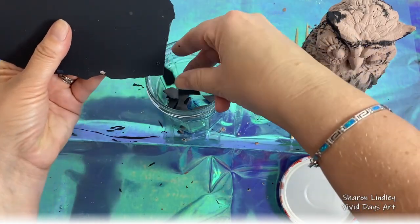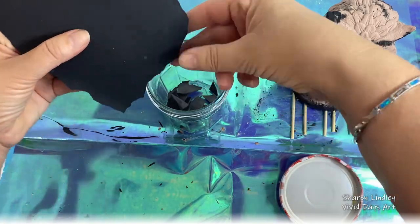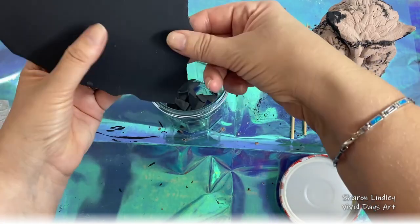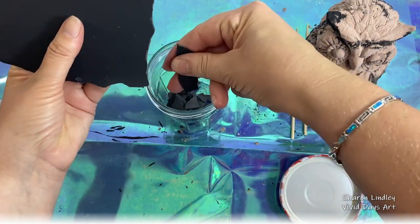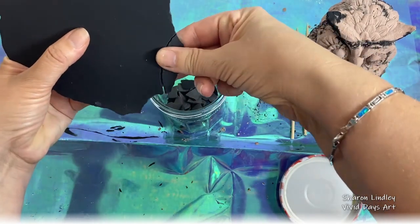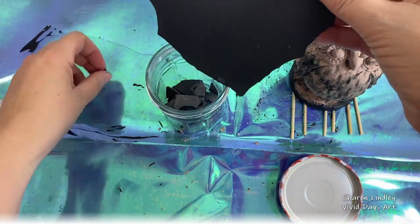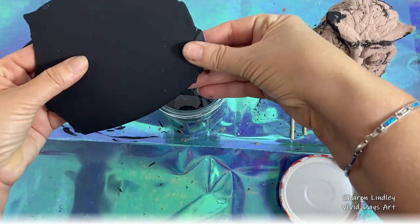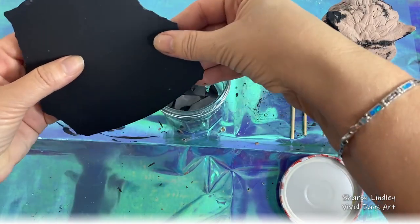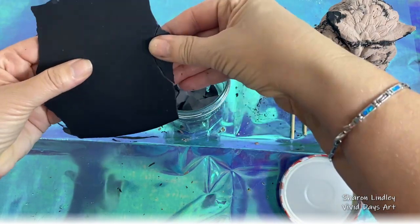But there is no wastage with Jesmonite. You've got all kind of purposes that you can redo it, but if you weren't to do it while it was fragile and brittle, it'd be very hard for you to snap. So immediately after I've demolded, you have also that window of opportunity to sand away or file away any bits that you didn't like on your owl. So you could smooth the edges where it's slightly imperfect, where I had too much pigment in there, and you've got time to adjust.